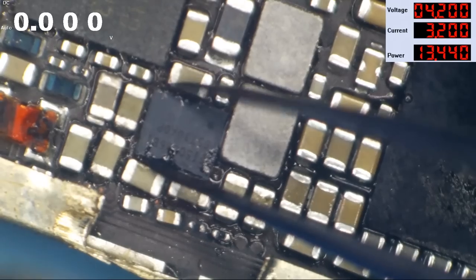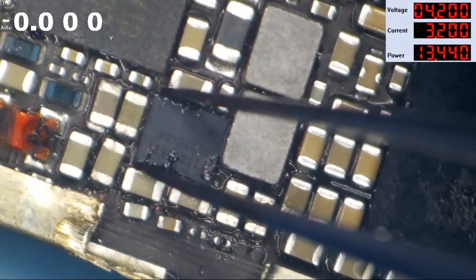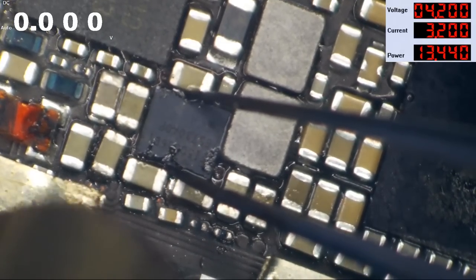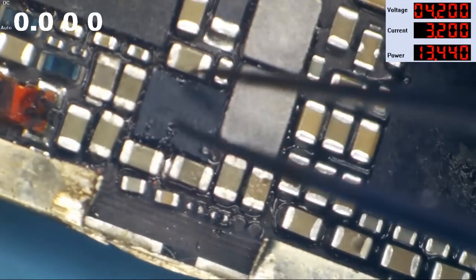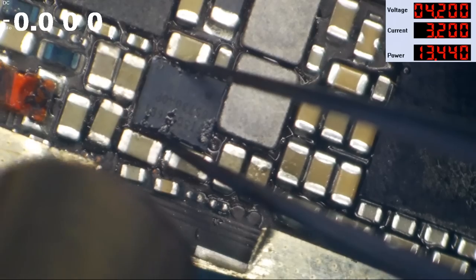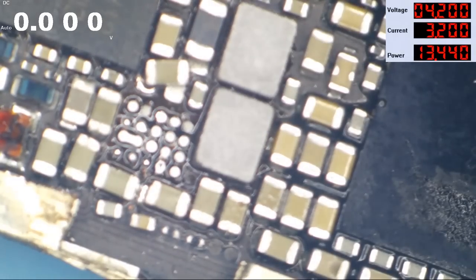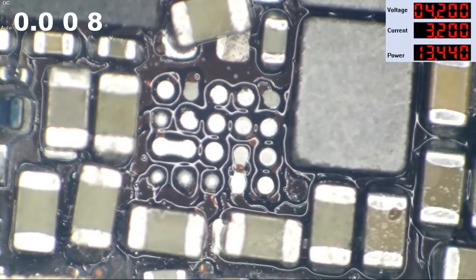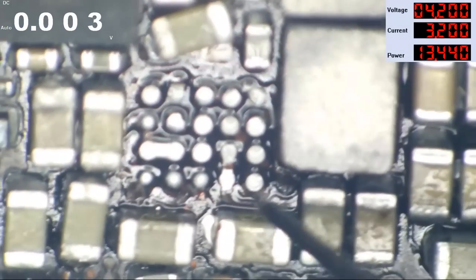This chestnut IC doesn't feel like it's been off here before — or at least if it has, they used leaded solder on it. Let me get a good grip on it and pick it up. We've got a second clumsy tech — only this clumsy tech just found a solder bridge. Let's look and see what we have bridged: these two are bridged, and that's it.